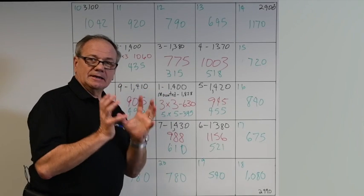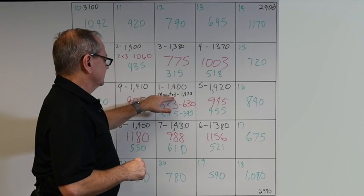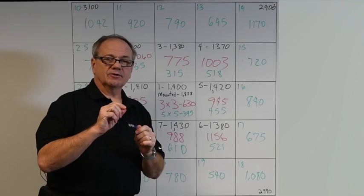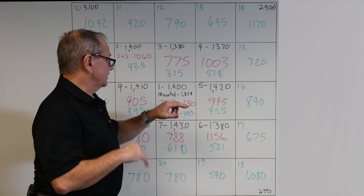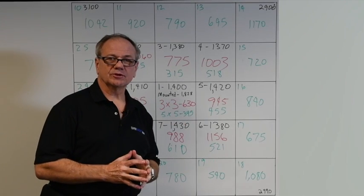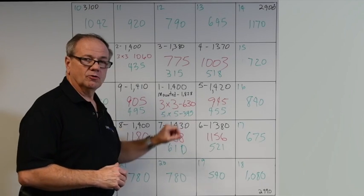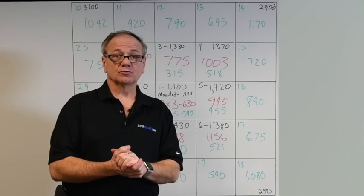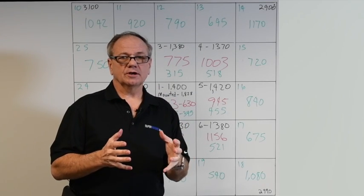Let's review what we've seen. The center magnet alone measured 1400 Gauss. Mounted on VHB tape with steel behind it, the field rose to 1828 Gauss. In the 3x3 grid, it dropped to 630 Gauss. In the 5x5 grid, it has dropped all the way to 345 Gauss at the center. If I took all these apart, the center magnet would read right back to where we started — it's its presence in this large array that's changing it.